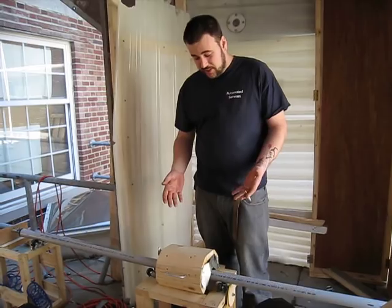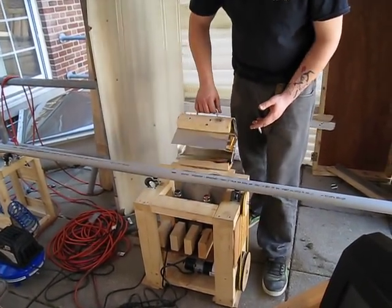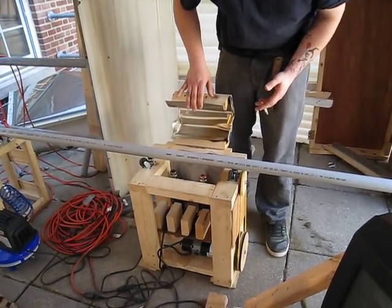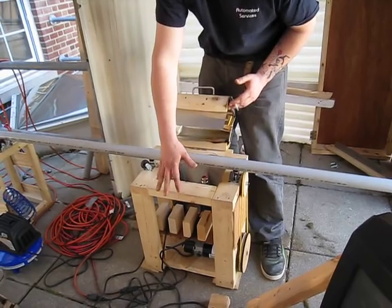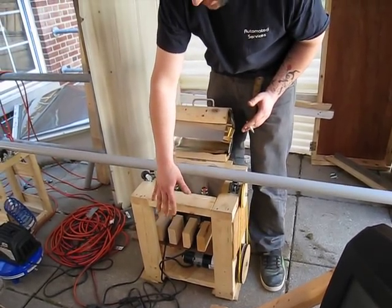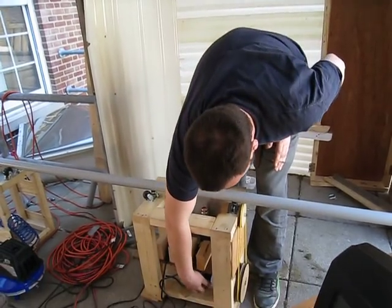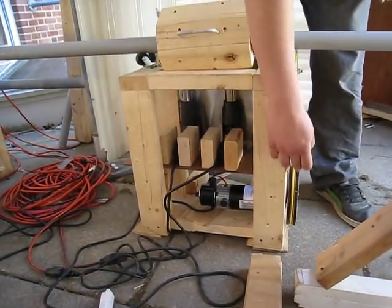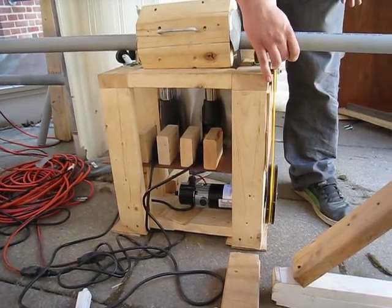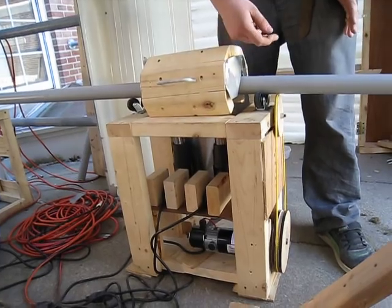While it's heating, we're going to explain the bending jig. What we have here is just a 2x4 frame. We have this clamshell lined with aluminum flashing. Two heat guns down here, and they're slightly adjustable because we need to adjust to get the temperatures right in every area. Down on the bottom here, we have a motor. The motor spins here, turns this belt, turns this pulley, and the belt itself is actually rotating the pipe.